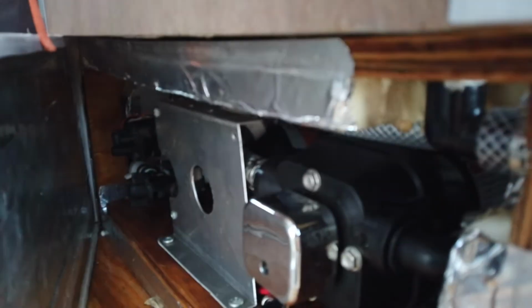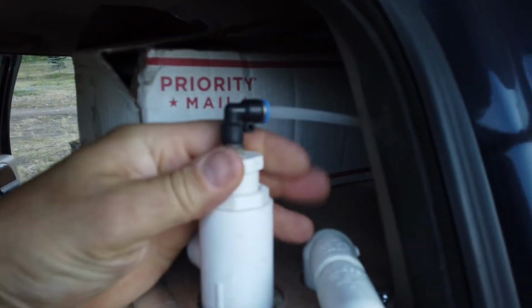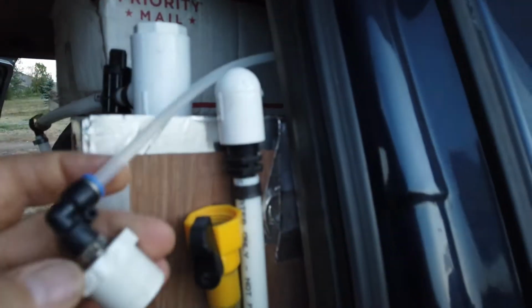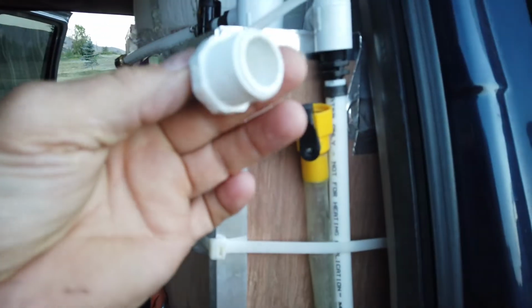And what I discovered was under the inlet of the tank, it's dripping from the inlet of the tank into the pump compartment. Well, it wasn't exactly from the inlet of the tank. And so what I started to do is I'm just going to drain the tank. And in the process, I happened to notice this. And this is the inlet to the tank, and the inlet to the tank has a plug. And on top of this plug is a return line from the reverse osmosis system. And it just so happened that this line was loose and laying behind the tank, down behind it.